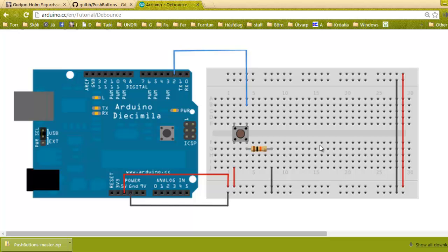I'm going to show you how to use many push buttons with Arduino. On this image you see an example of how to connect digital pin 2 on the Arduino to a push button. You will start by putting the 5 volts and connecting them to this pin. This pin should be connected to a 10 kilo ohm resistor, which should then be connected to Arduino ground. The other side against the resistor should be connected to the digital pin.